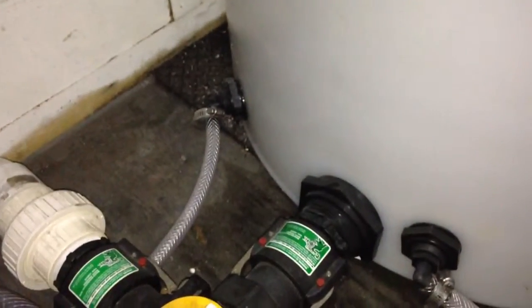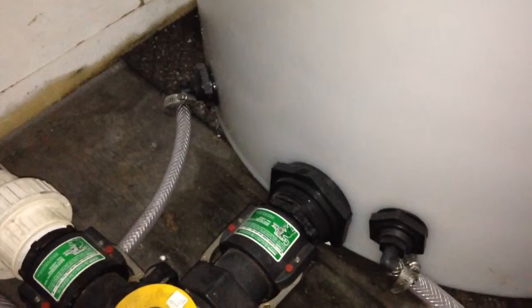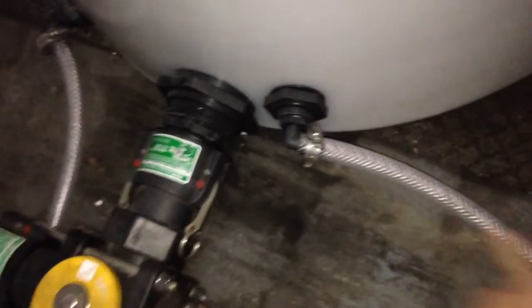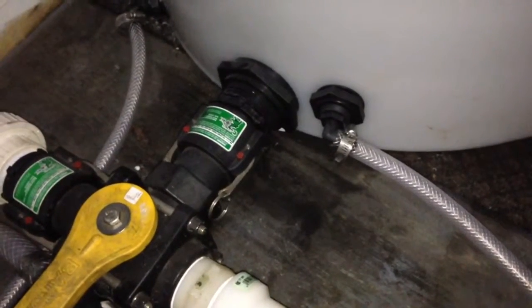This is the bypass line, and I have both bypasses plumbed into the bottom of the tank — it's the first time I did this on a setup and I like it. When you have it coming from the top, it stirs the water up a lot and can cause air bubbles in your supply line. By doing it down here underwater, it doesn't create those air pockets. I've also heard that the water flow from the bypass on the bottom keeps debris from settling and getting caught in your line and eventually bypassing your filter into your pump.